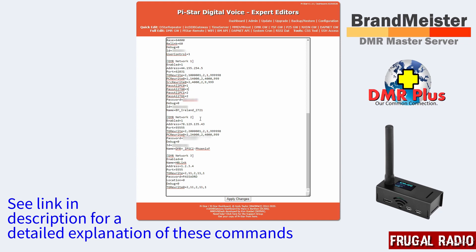Similarly for Network Two we have the same kind of setup. I can see Network Two is the Phoenix F server on DMR Plus network, and here I just have the two rules: the talkgroup rewrite and the private call rewrite. It's listening on timeslot 2 — it's a simplex hotspot — and it's listening for the seven-digit number beginning with the number 2, and it's going to translate that output onto timeslot 2 on the network side, beginning at talkgroup number one.